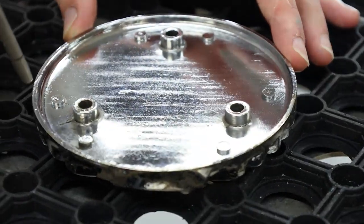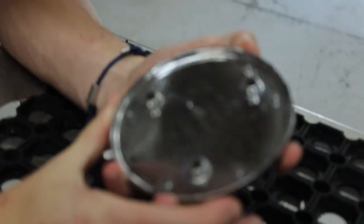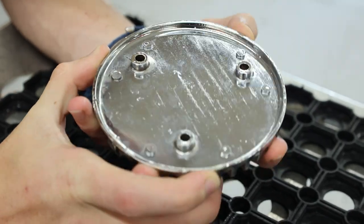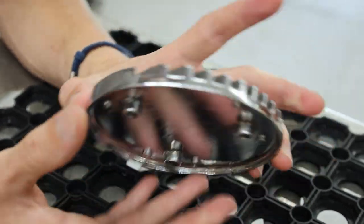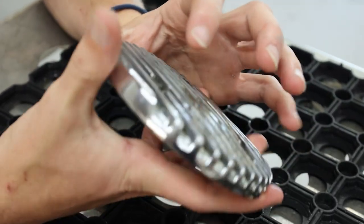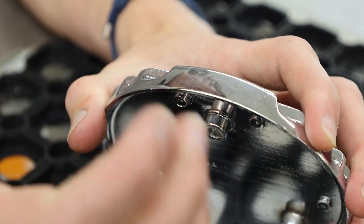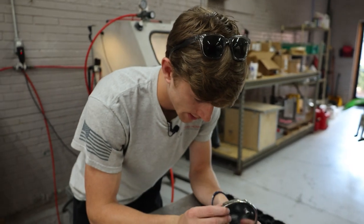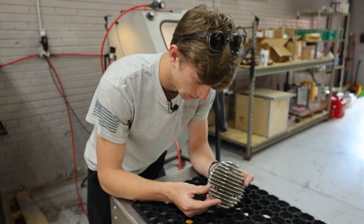Let's be honest — I do think there is more shine on the underside. I think just rolling over it with some glass bead did bring a bit more shine back. It doesn't look fabulous, but I think it did help, and with more time that would work. The top side around the edges does look better where that chrome was. So if you have chrome that's in good shape, running over it with a low pressure glass bead is going to help. But for sections where the chrome was already in bad shape, in my opinion, it does not look good.